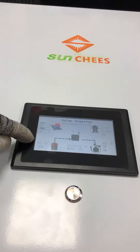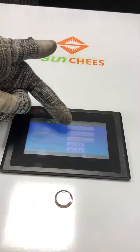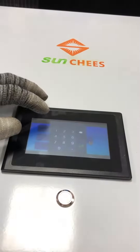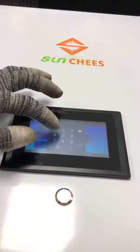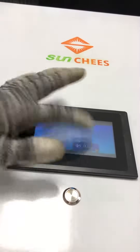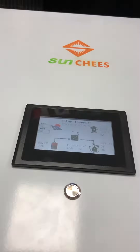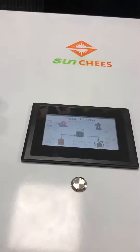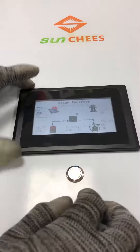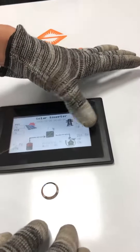The battery icon shows the battery voltage and remaining capacity. Battery remaining capacity is 96%, and you can see the shutdown voltage and alarm voltage. For example, the shutdown voltage can be set to 44V and the alarm voltage to 45V. You can do the settings yourself, but we don't suggest you change them because before we pack the goods we set all the data correctly. When you receive our goods, no need to make any changes — just connect the system and let it work. This is the loads icon — you can see the output voltage right now is 221.5 volts.